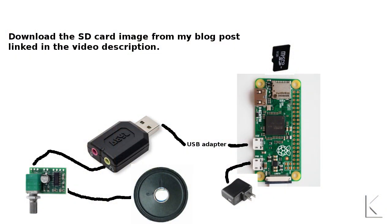As far as building it, everything is pretty straightforward. The USB adapter that comes with the Pi Zero will let you plug in the audio interface. You'll need to connect the audio interface's headphone output to the audio amp's input. The audio amp is going to be powered off the Raspberry Pi. Your eight-gig SD card is going to contain the operating system. I've created a custom Raspbian image that boots right into software that does the Morse code decoding. I discovered that the Raspberry Pi organization already had a tutorial on their website involving decoding Morse code — made for students, written in Python. I had to do some modifications and updates to get it to work on current Raspbian, but it worked out as a great base. I've modified it to include the eSpeak library and optimized a few things about the Morse lookup table.